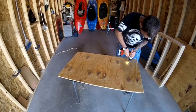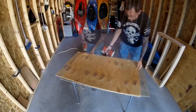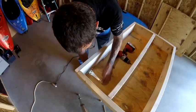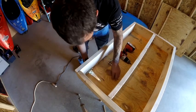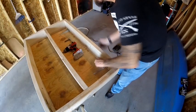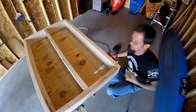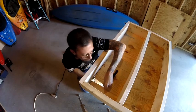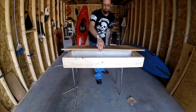Once the top is cut, I'm going to drill the holes to add the hinges. I'm using two six-inch hinges on each side and one-inch zinc plated machine screws to fasten the hinges to the plywood. I've also used a number eight one-and-a-quarter coarse thread drywall screw to fasten the hinges to the two-by-six. I did place a third hinge in the center because the frame needed a little more support.